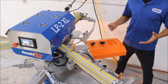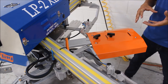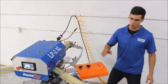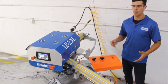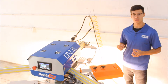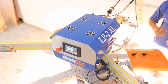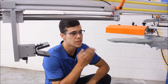This is the flash gear. What we use is high-density quartz lights. The purpose is to basically double the heat ratio of a normal conveyor dryer, nearly eliminating the time factor. Once it's printed, it comes right under this unit — with dots, it typically takes anywhere from two to about five seconds under this lamp to give you a nice cure. We have a second lamp here for insurance purposes, so after the first cure it goes under the second head, giving you that nice finished product.